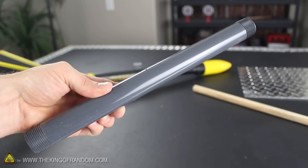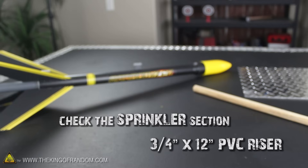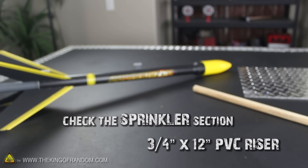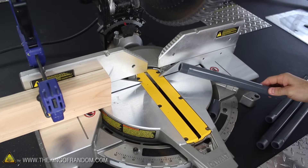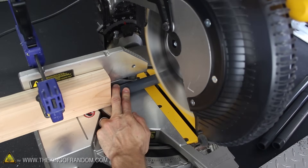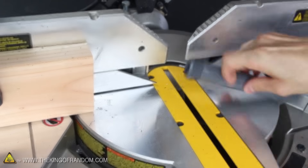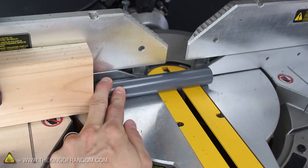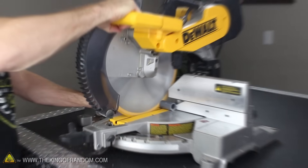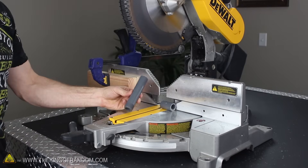While we've got that warming, let's move on to modifying a few 3/4 inch by 12 inch PVC risers, which you can find in the sprinkler section of your local hardware store. I clamped a piece of wood to my chop saw exactly 5 inches away from the blade, which gives me the option to line up the threaded edges and cut the tubes cleanly at exactly 5 inches long every time. You can flip the riser around and do the same thing with the other threaded end, getting two 5-inch motor casings from one riser.